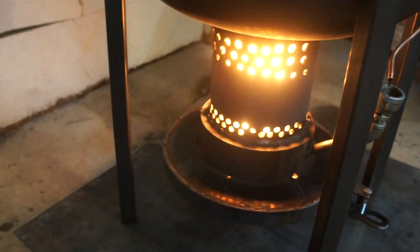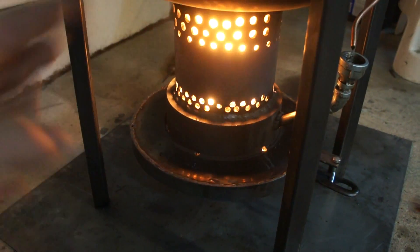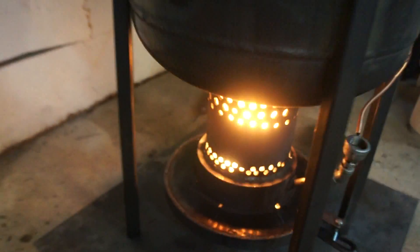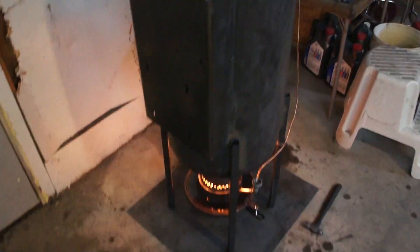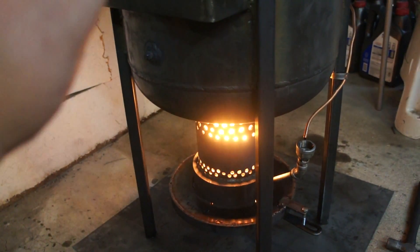The more top holes I put in didn't seem to affect it, and I proved that with the air compressor — putting just a small amount of air in those top holes showed really no flame activity difference. So I moved that same tube with the same amount of air into the lower holes and the flame took right off. We also found that a flue dampener like a wood stove — you can't use that; it doesn't even work. As soon as you damper that, it changes the velocity and everything stops working correctly. You would have to retune your holes to match the dampener, because you're tuning to your chimney — that's how this whole system works.